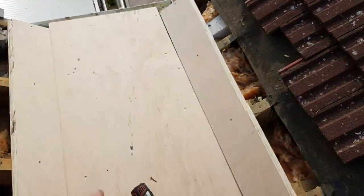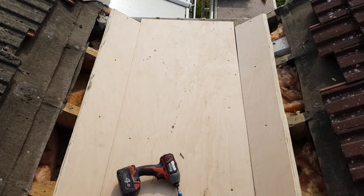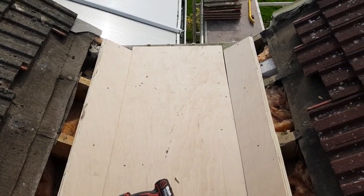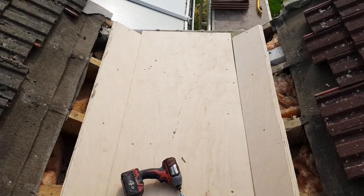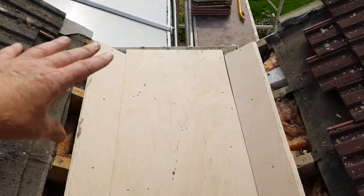There was a little bit of missing insulation - the builders missed it when they put in this box gully extension. Luckily the client had some rock wool inside, so we replaced that to prevent any dew point or condensation gathering from underneath the void inside the ply. We've put new 18mm ply down.